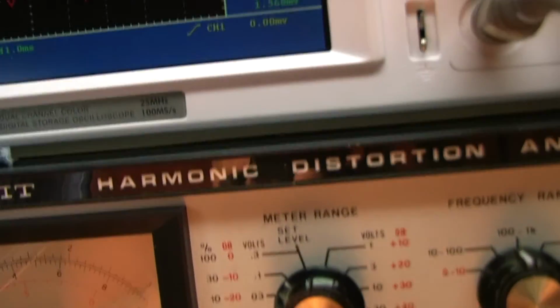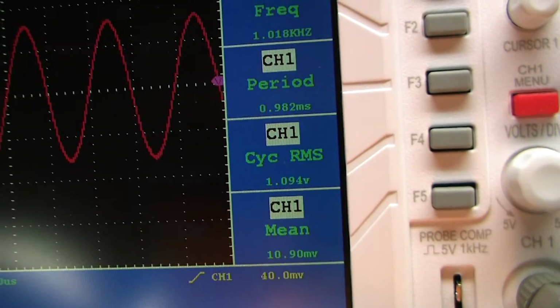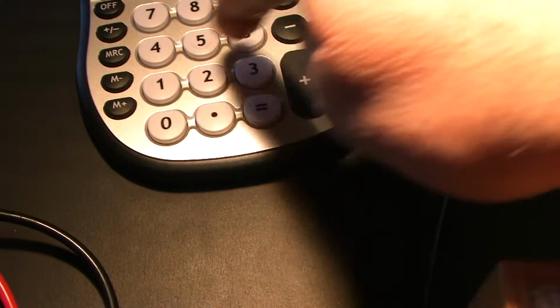So that's too low. Okay, let me switch the oscilloscope over to the orange tap, the orange line from the secondary, and we still maintain 7.6. And for an output voltage, we now have 1.093, 1.1. Wow, that's going to be low, isn't it? 7.6 divided by 1.1 is 6.9. So that's a turns ratio of 7. That's crazy. Couldn't use that.